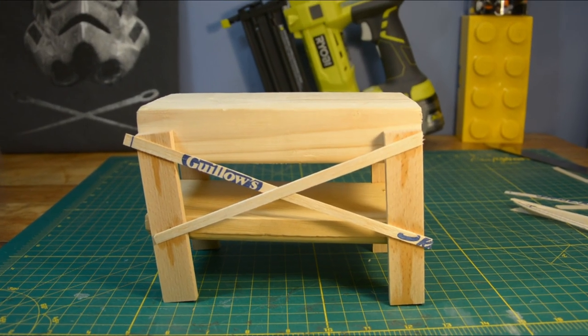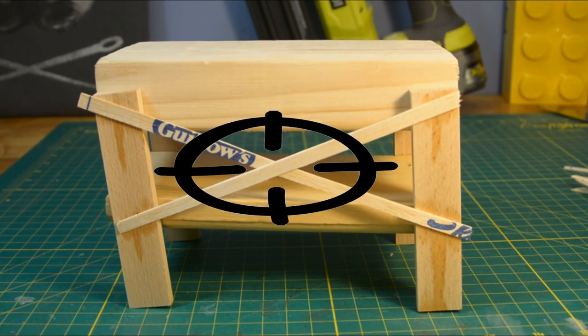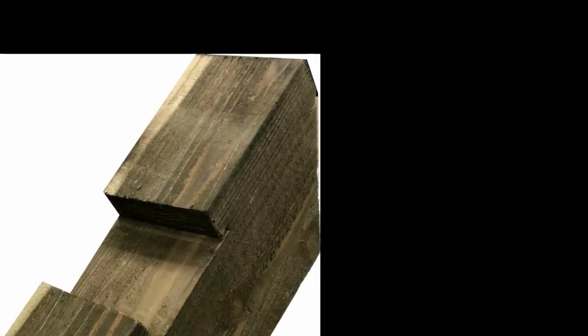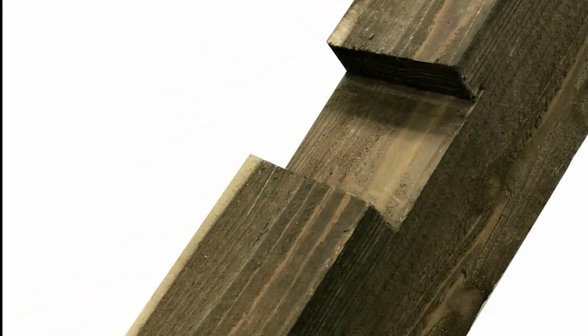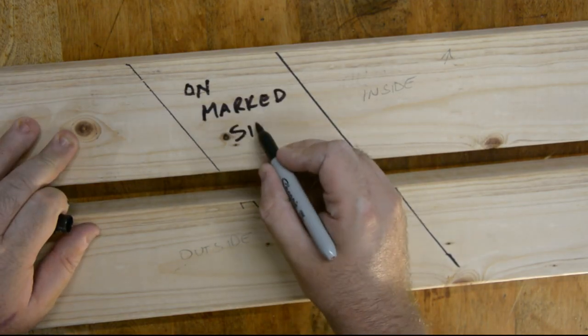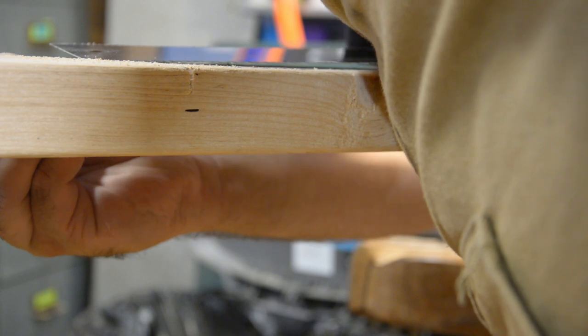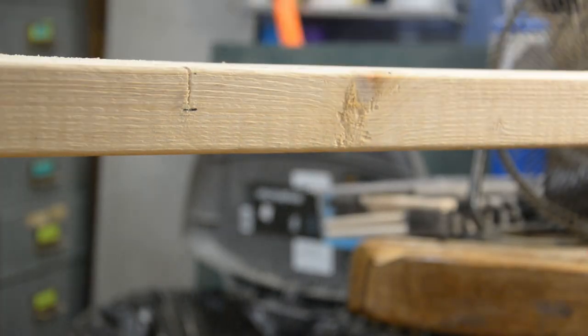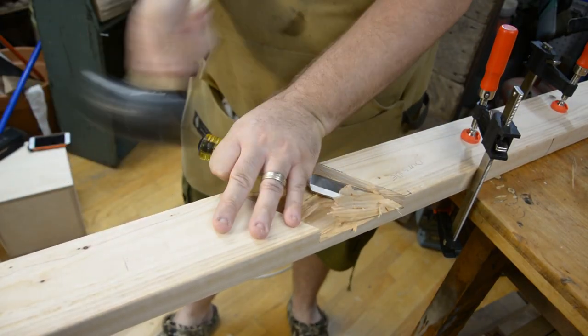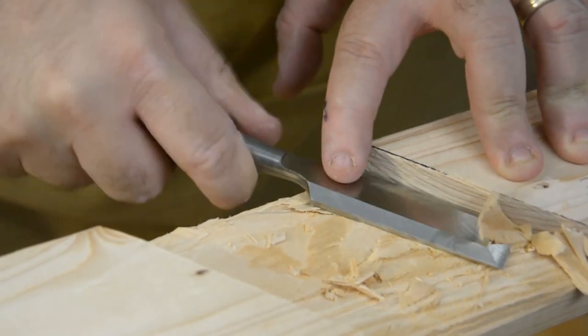When we were looking at mini bench, we quickly realized that the point where the 2x4s cross would give us the biggest issue, because 2x4s don't bend like thin pieces of wood do. So the plan is to notch out the 2x4s so that they fit together, offering us even more stability. Where the wood crossed, we're going to cut halfway down into each along those marked lines. I marked the line on the side of the board halfway down so I know where to stop cutting, then chiseled those sections out to that same depth, making sure to carefully clean out the notches so that when put together we get a nice snug fit.